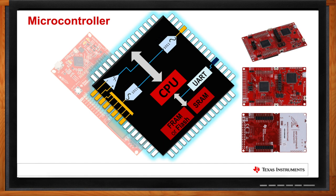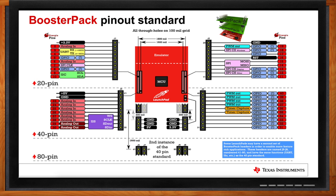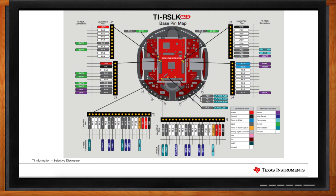Can we talk about the pinout of this development board? The TI RSLK Max provides a lot of modularity for students, from foundational classes all the way to more advanced classes. Using the Launchpad's BoosterPak pinout standard, there's a standard way for students to interface their circuitry — whether breadboard circuits, BoosterPak plug-in modules, or other custom hardware. We've developed a pin map for the RSLK Max that utilizes all the onboard sensors and motors, and students can add additional capabilities using the pins accessible from the microcontroller.